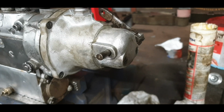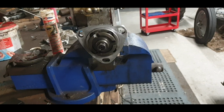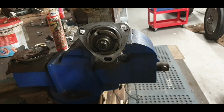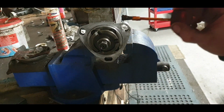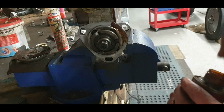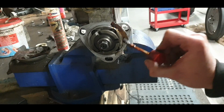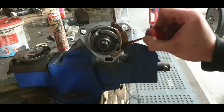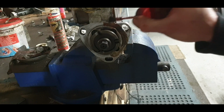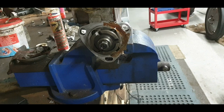Our gasket is made. I'll put a bit of Indian head on the front. I'll fit the gasket to this. I think that is probably the best idea, yeah. Plenty of this stuff, because I can tell you one thing, when these things leak, these flanges can be bent. The one on my 20 diesel behind me there, I've only worked out lately, is actually bent from people overtightening it. Probably tightened it unlevel, we'll say.